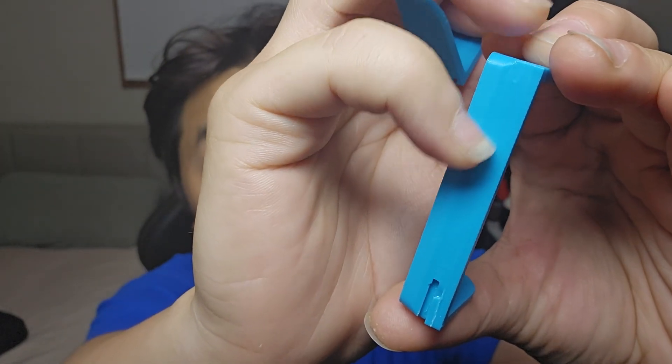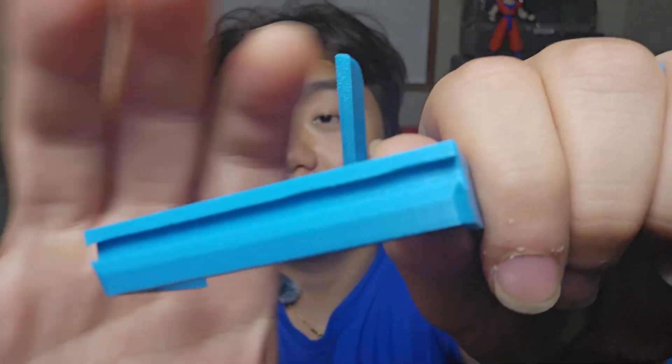Of course, you need support right here. Once I printed this and fit it, it fits well. I just measured this corner right here and modeled that in there. After that, I did another remodel to make the connection — the dovetail joint. I was thinking of using a similar connection I used on the Cobra S1, but that is not really secure and sometimes it might come off. So I just went with a dovetail joint to make it super secure. This was the first part of the dovetail joint test piece, and I made a custom support here for the joint. But this one was so hard to remove that I had to do another redesign with tiny attachments to the actual slide so it supports the dovetail joint and does not sag. You can print it really nicely and just rip it off very easily. That took two tries and I'm still proud of it. I modeled everything, then print, and boom, that's what I get.